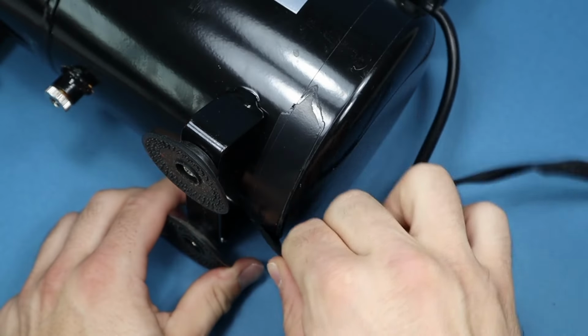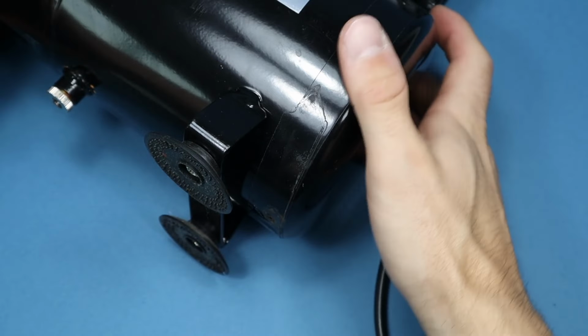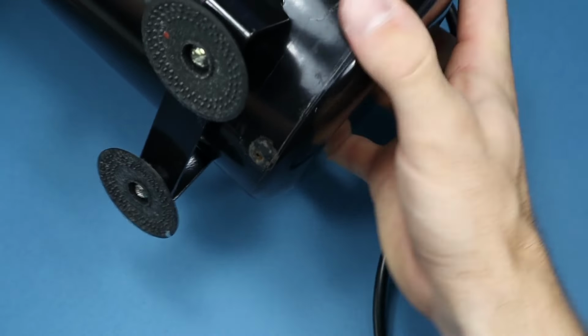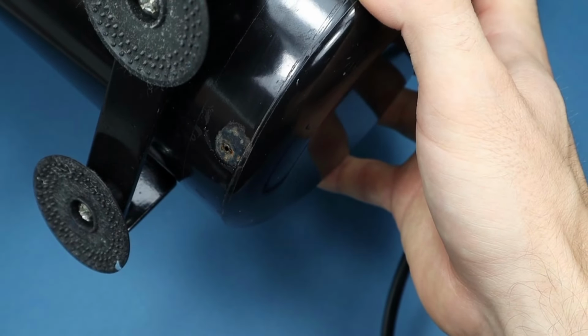This is my old compressor which I had for about 5 years and it was really reliable. But I didn't empty the tank and it burst at the back. I highly recommend not resealing or fixing the hole, as you can't be sure how much of the tank has rusted away, and fixing it may result in a second more violent burst. The best thing to do is just keep an eye on it and empty the tank every so often.